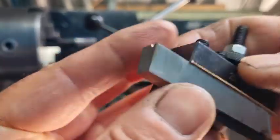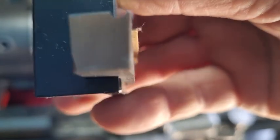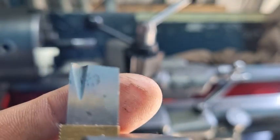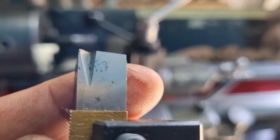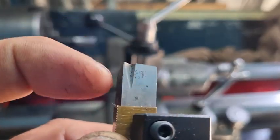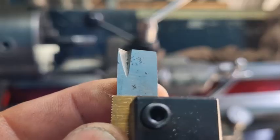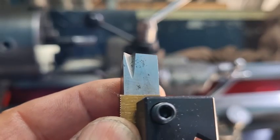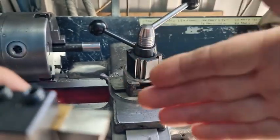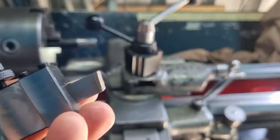On the side here, this is the cutting edge — you've also got a little bit of a slope as well. If you look closely you'll see the chip breaker right there. That little groove is just put in by the edge of the wheel. This is the cutting edge at the side, not the front, and you can hone that on a diamond dressing stone or an oil stone. When I put this edge on, I just sat it up against the grinding wheel — the grinding wheel has a curvature on it, so it grinds the bottom before the top, and that's generally enough clearance.